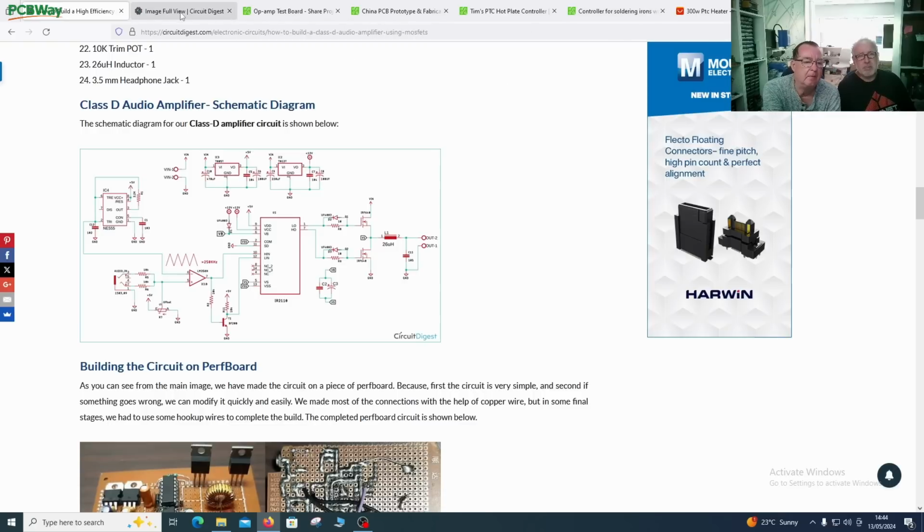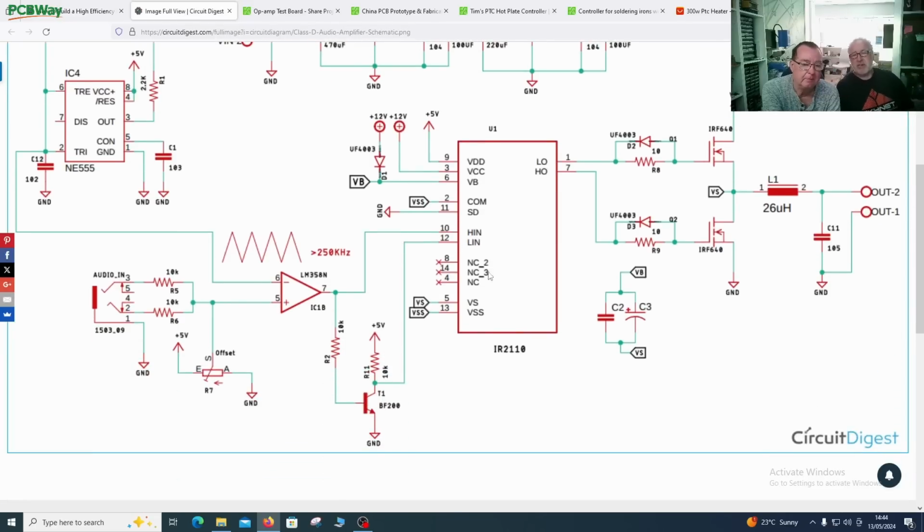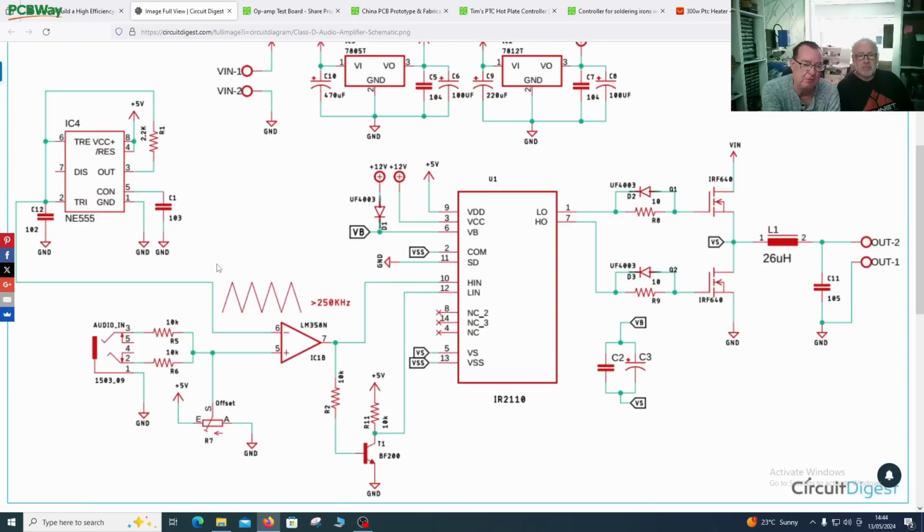And there is probably at least one error in there. And then we found this thing, or Richard found this thing here. The one that Great Scott did used a 7404 inverter, but only one of the 6, which is overkill. We looked at this and we actually talked about using 2 op amps, didn't we? Yeah. I'll tell you how this works and what we thought. We should probably explain what this thing is doing.